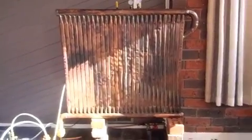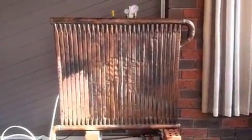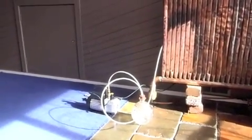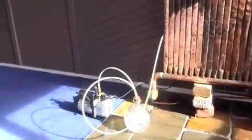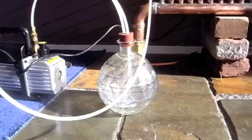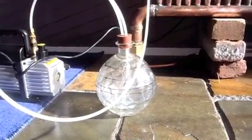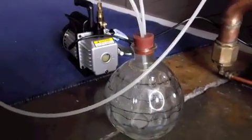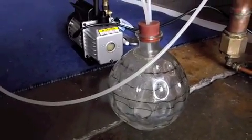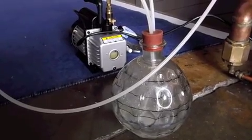This is the visual part of the heat pipe which is in our chimney — this is the condenser. It's filled with water as the refrigerant. It's been vacuumed down as far as it could possibly go with a vacuum pump normally used for refrigerant. In front of the vacuum pump is an accumulator to stop water going into the pump, and it's also how I suck water into the system. It holds about 2 litres of water so I have to top it up a couple of times to fill up the system.